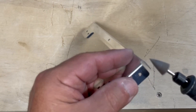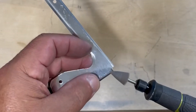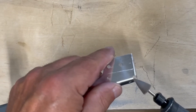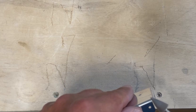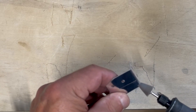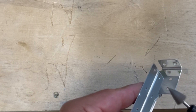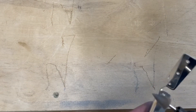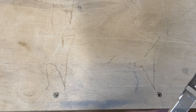That cone shape is great for getting into all these tight spaces, and because it's a cone you can use it on larger edges as well as smaller edges — it fits pretty much anywhere you need it. As a side note, if you use this on a straight edge you'll end up with a groove worn into it fairly quickly. On your main scotch-brite wheel you typically want to avoid that, but I actually found it works nicely here — letting it wear down grooves in a couple of spots is handy for short straight edges, because the groove gets the flat edge as well as both sides at the same time.